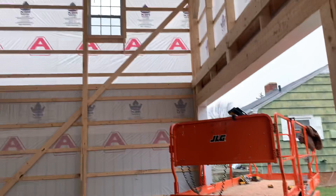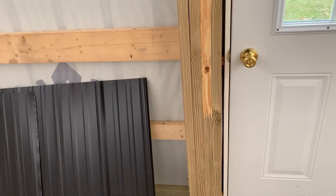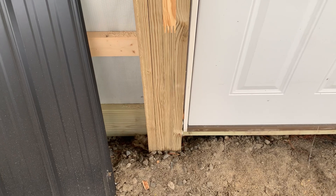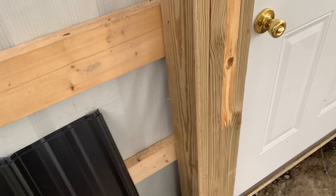At the peak it's like 26 feet 10 inches or so. We use a four-ply, and you see a lot of videos with three-ply — these can come in different forms. It's southern yellow pine, glued laminated with finger joining, two by sixes. You can see how that is constructed.